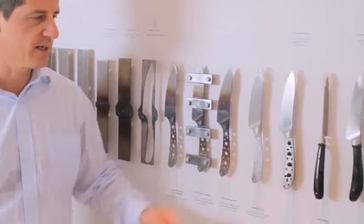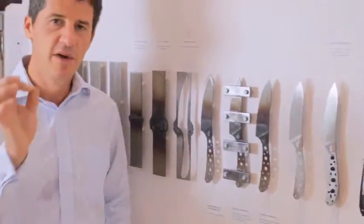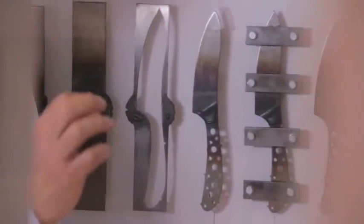You'll see here we get the grinding on the blade, and this forms the V basically for the blade itself. 1 millimetre from the tip is 0.25 millimetre wide, so very exact and very engineered product, so that time and time again we get a world-class cutting edge.